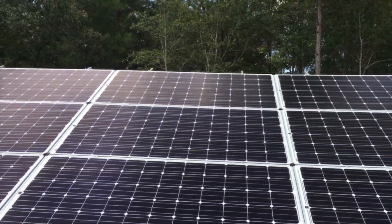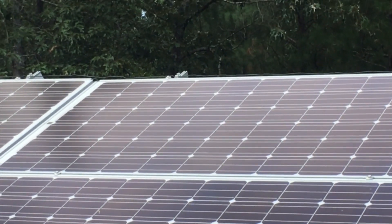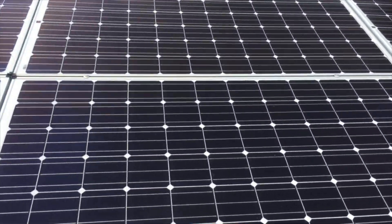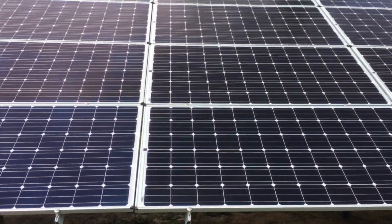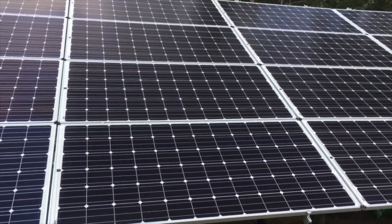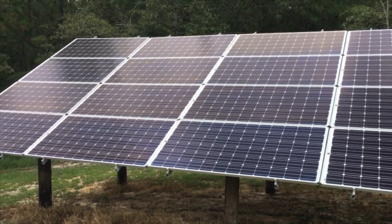At the very top I have an electrical wire — it's actually a copper grounding wire. That's what's grounding all of them together. One of the things I like about the SolarEdge product with the power optimizers is that should one of these panels get shaded, the power optimizers boost up all the other panels to make up for that loss. At the time of this recording, string inverters couldn't do that — if one panel gets shaded, it holds the whole string down. I have two strings here and I want these things going as much as possible, so that was one of the selling points.